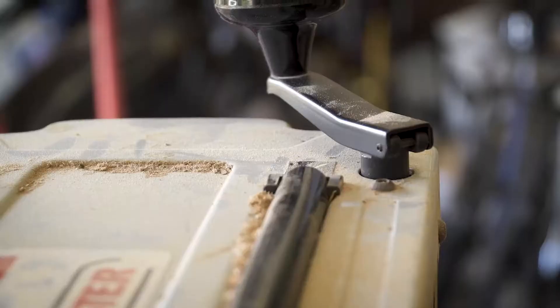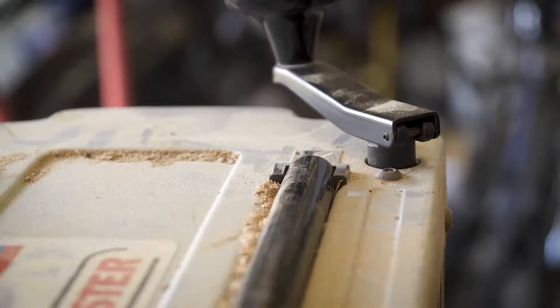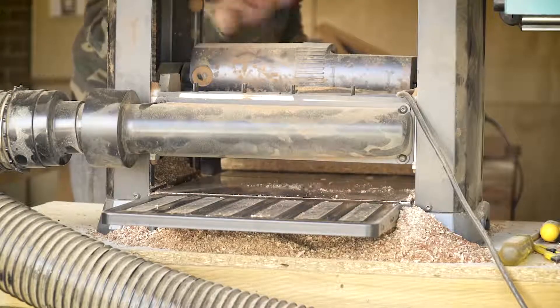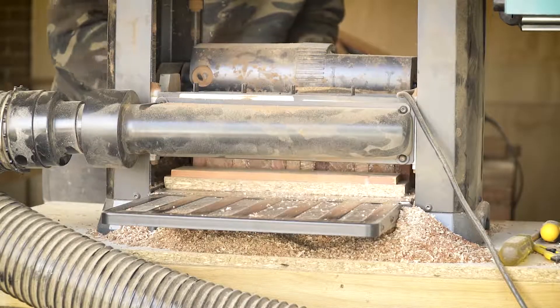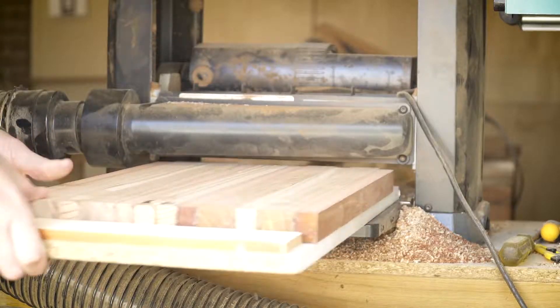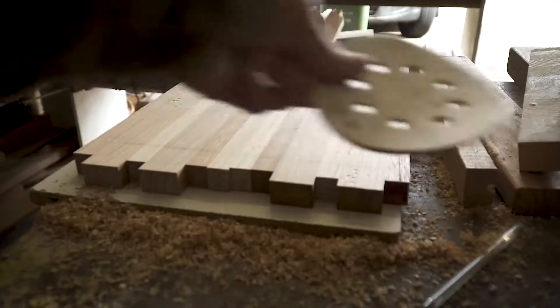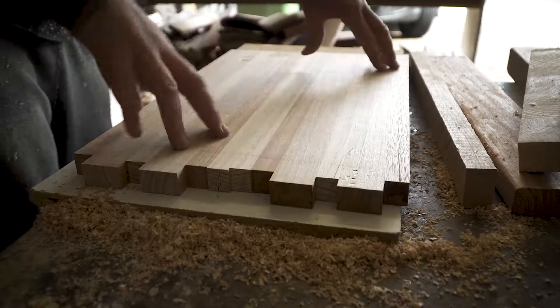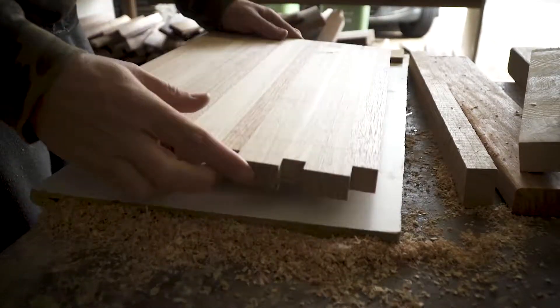The first couple of pass-throughs almost don't touch the board — just to make sure you don't jam up the machine when you're setting it up. For each pass-through with hardwood I usually do just under a quarter turn, which prevents jamming. I'll work on one side until it's basically flat and clean of any glue, then repeat the process on the other side, getting both pretty good before starting again on the original side to finish the job on both sides.